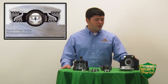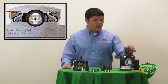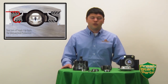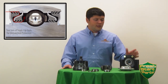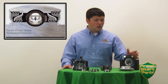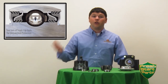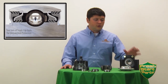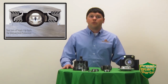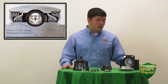The other style of bearing here on the table is a heavy duty ball bearing style roller bearing with a six lip seal as well. These are used in a lot of our heavy duty tillage tools, such as the 7000 series disc and the Turbo Max. These bearings, while they are a ball bearing and sealed, are totally maintenance free. Unlike the tapered roller bearing that can be rebuilt every couple of years, these are going to go for the life of the blades as well. Every so often when it's time to replace blades after a couple of seasons, we recommend going through and replacing the bearings all together when you do that.